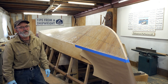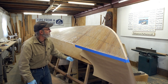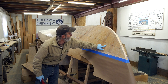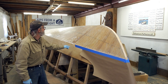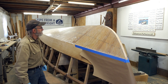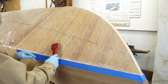I don't do a lot of sanding — I don't want to make much dust — so I've got a scraper, nice and sharp, and it does the trick. We just scrape around a little bit. Maybe there are some imperfections in the cloth with the last layer — some stripes that might be a few thousandths of an inch thicker — but the scraper will take care of all of that. I'm going to do a little bit of scraping; I've sharpened my scraper.